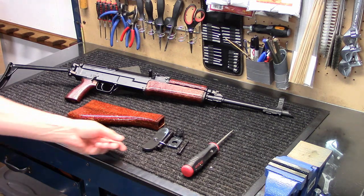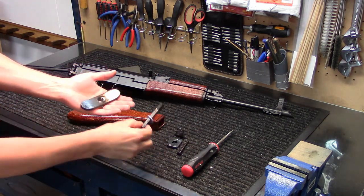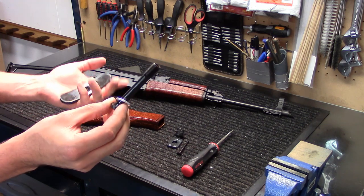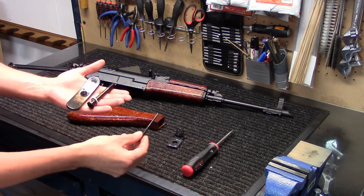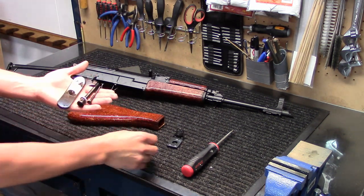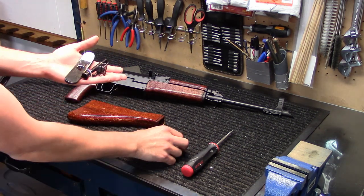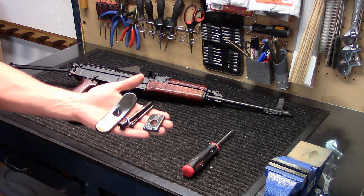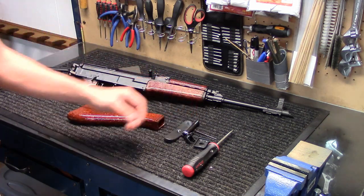After that I just cleaned up the metal parts that came with it — the butt pad, the screw that holds it in, and the sling swivel. The screw is actually much longer than the folding stock screw, so there are two different screws — you'll note that when we do the install. There's also the front base pad that goes on the front of the stock. I cleaned all of it up, oiled it, and got it ready to go so it lasts a good long time.